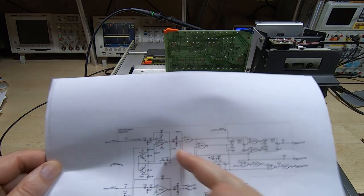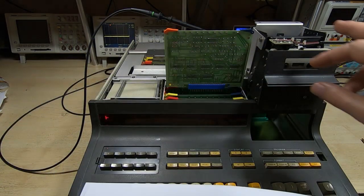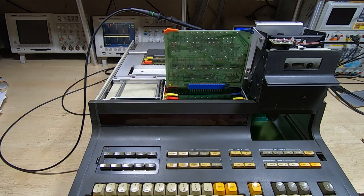I've got board 63 in the riser. We want to look at test points five and eight — the outputs from the two channels. We're on test point five, which is channel A. We'll try the mark command with five files each of 100 bytes and see if we're getting any data on the scope. We are — and we should see a much lower level signal when it reads this back. That's interesting — it's actually successfully written to the tape.